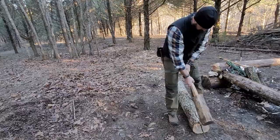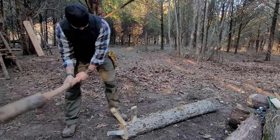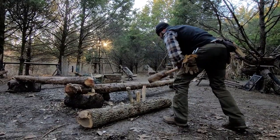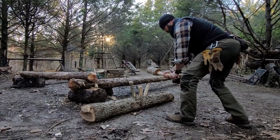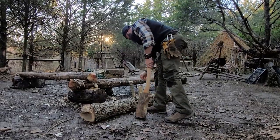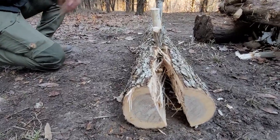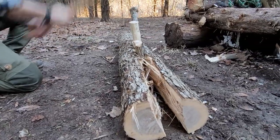Seasoned wood is always better than green wood, but green wood works just as well, relatively close — it's just not going to last as long and not going to be as durable. Will made a split with the axe at the end and then utilized that small split in order to pound some wedges in with a handmade mallet. You'll just start at one end and keep adding wedges and pounding them in to depth until the entire piece of material splits out.